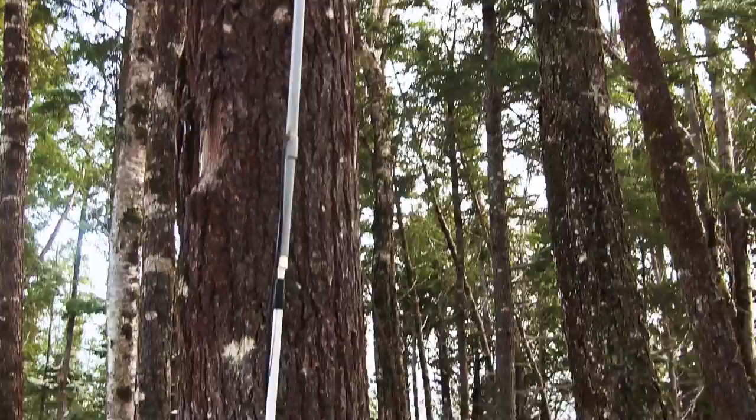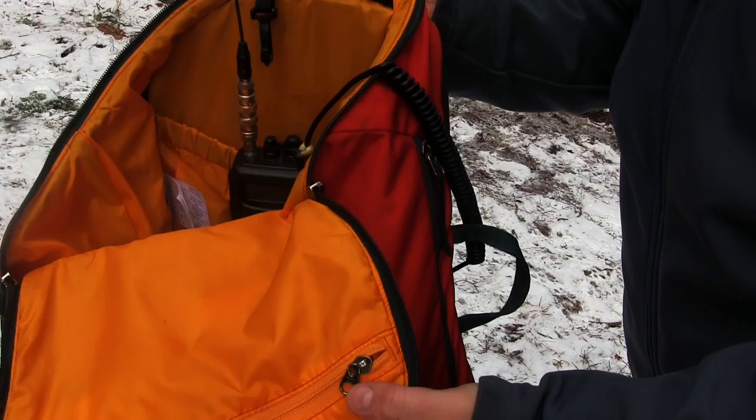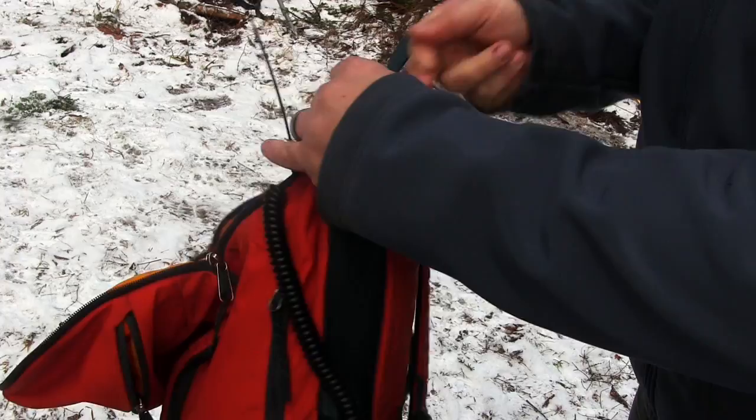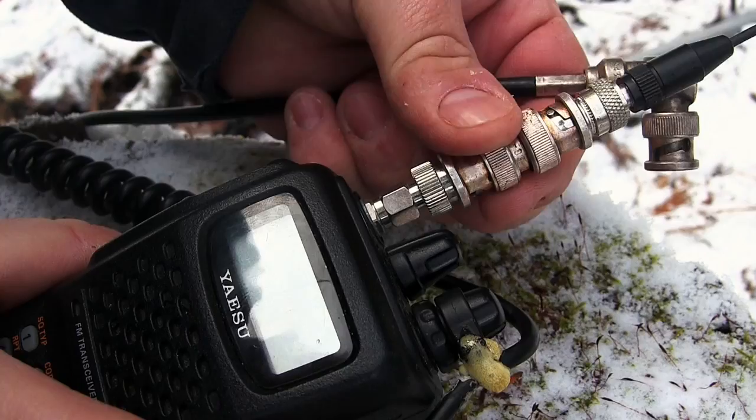If you really want good reception or signal strength, get a little aluminum painter's rod. I found one that fits nicely into the j-pole and also fits the diameter of my tripod. What you end up with is an antenna that can go up over 20 feet — great for use on a summit. My setup was to have the radio on my shoulder strap with a whip antenna, and at camp I'd haul out the j-pole with the quick coax connector — snap out, snap in, really quick changeover. For car camping you can bring the rod and tripod and set up a great base station.